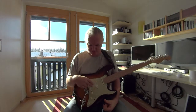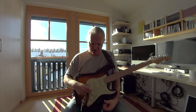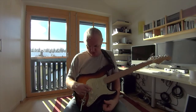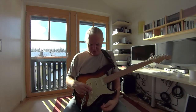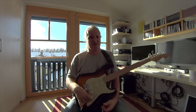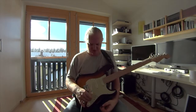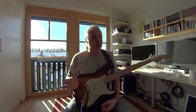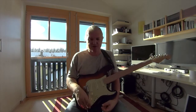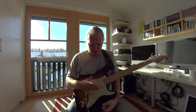Also remember, when you use normal Stratocaster pickups, you have to change the tone and the volume knobs too, because in the S1 noiseless system there are 500K pots. They have to be 250K. Very important, because if you use the 500K from the S1 switching system, your pickups will be much too bright. It will not work, and you will not be happy with the changed pickups, no matter which one you buy.